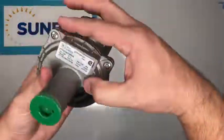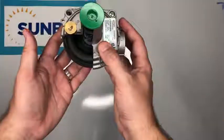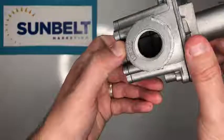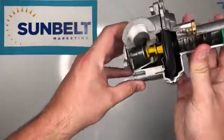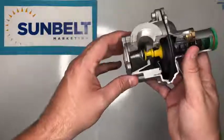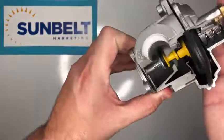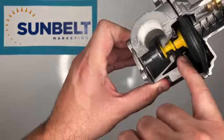A quick overview of how gas moves through the Pietro Fiorentini. We have our inlet side here, and if we flip it over, we have our outlet side. Gas comes through the inlet side — you can see my pinky moving behind the unit — fills up that chamber, and it reacts with the diaphragm, the spring, and the yellow part, which is the balancing piston.